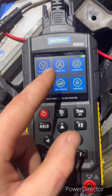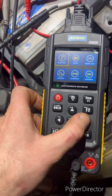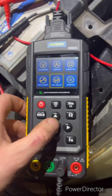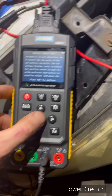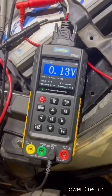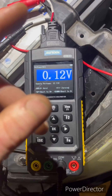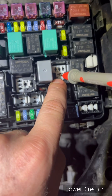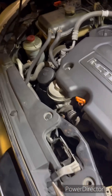So I'm going to use the DM303 — going into our vehicle circuit test. It gives us a bit of information and we click okay. We are beeping now. It has to be powered to the battery for this particular test, so we have a probe into the load side of this compressor clutch.